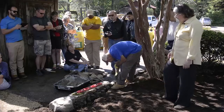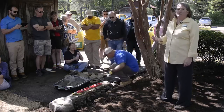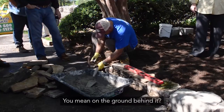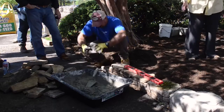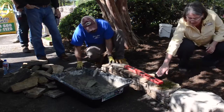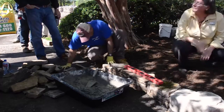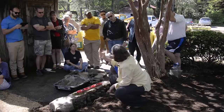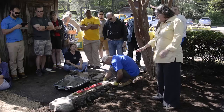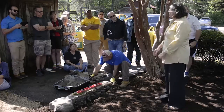Question: If you're filling in behind, do you wait a couple of days before you backfill? Not necessarily — you can go ahead and backfill right away when you finish the wall. You don't have to wait until all the mortar dries out. For this kind of wall, put some rubble and some gravel behind — that's going to add to the drainage so you don't end up with a soupy mess. Fill in on a slant behind it just below the cap so the capstone leaves enough space to add soil and mulch.